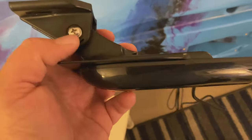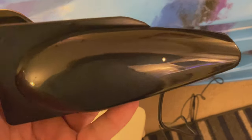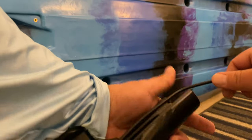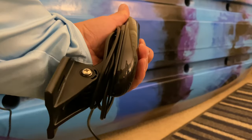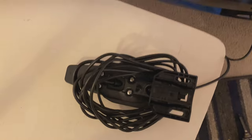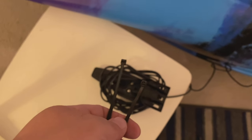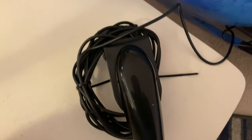So that'll grip as you tighten. Once you tighten that nut and screw down, you want to go ahead and start wrapping your cordage around the transducer. To do that, I just take my hand like this and start wrapping. You'll have a lot of excess cordage. Once you form something like that, you still have plenty of cordage to go through to plug into your fish finder. Garmin gives you a couple zip ties — go ahead and zip tie both sides. It should look something like this.